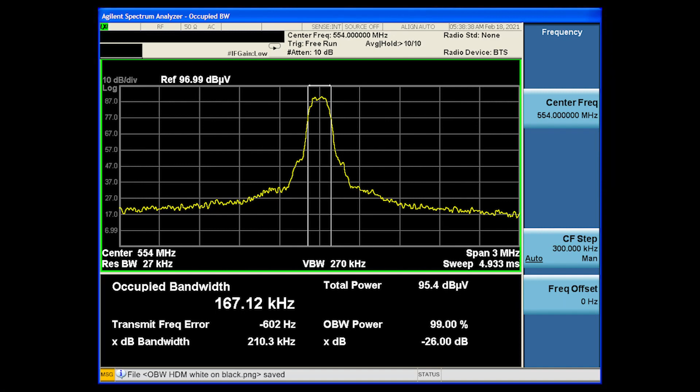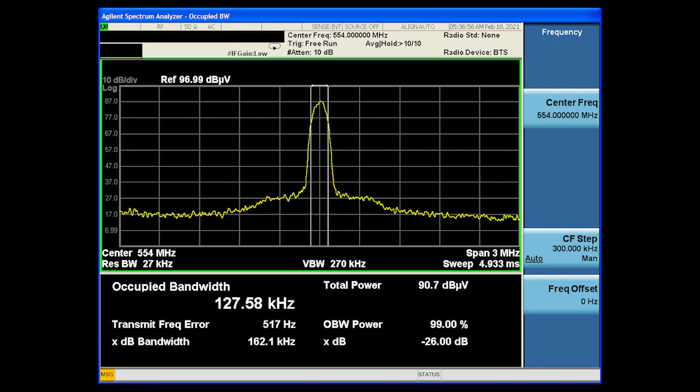Let's get into the high-density transmission mode. When compared to normal ETSI-compliant RF carriers, HDM allows for much tighter channel spacing, yielding well more than double the operating frequencies per given spectrum. The occupied bandwidth is half, or 100 kHz, which is quite narrow. When selecting this mode, the RF power is set to 2 mW, meaning the units can be quite close together and the carriers can be spaced closely with no intermodulation issues.